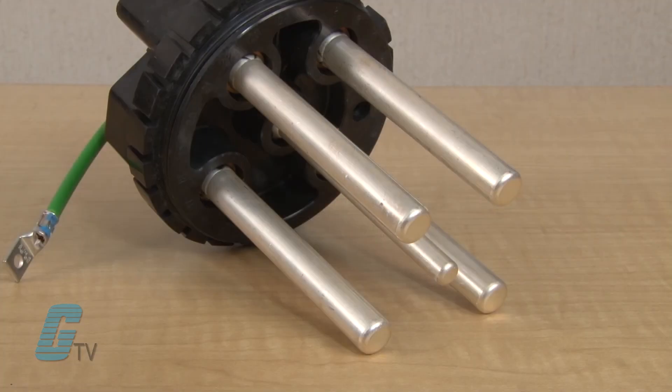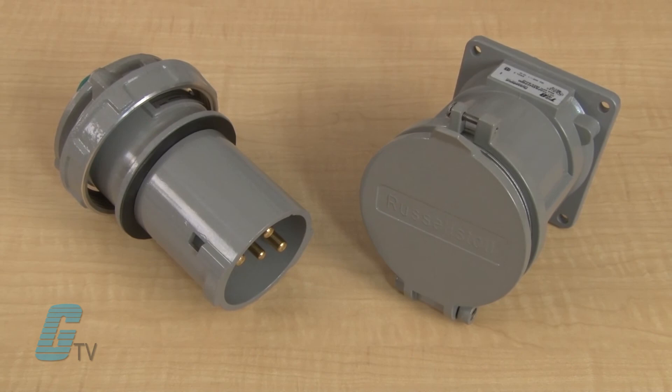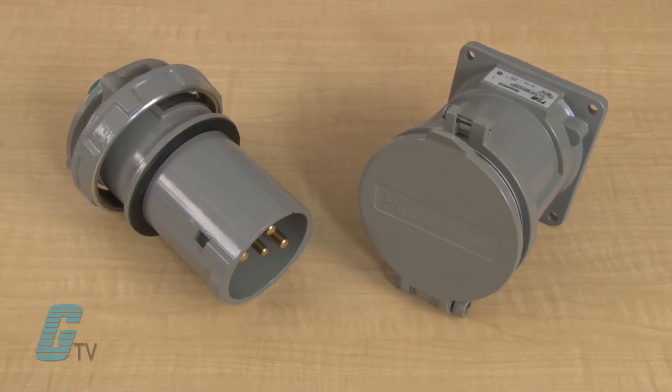The pins and sleeves are made of a marine grade CDA 485 brass and are silver plated with models rated for 200 and 400 amps. Two optional pilot control pins for contactors, load monitoring circuit, or shunt trips are available. These are designed to make last and break first.